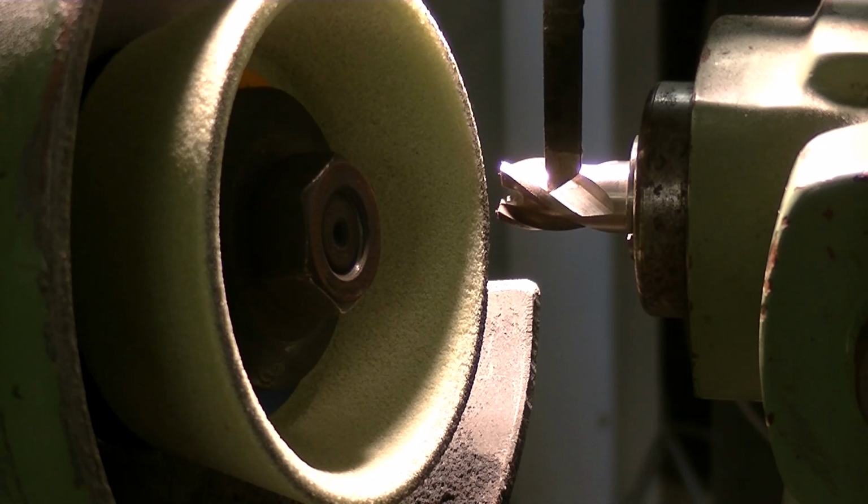But be very careful with your positioning, and with all of these cutters, don't try and take 15 thou in one cut. You'll overheat the cutter, and you'll make the wheel glaze over very, very quickly. These machines in this sort of job are only designed to take 2 thou, maybe 3 at a time. And when you're on a more rigid machine like a surface grinder, only try and take about 1 thou to 1 thou and a half per pass.